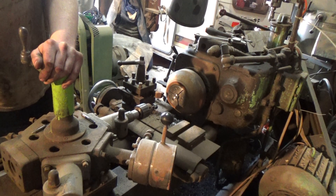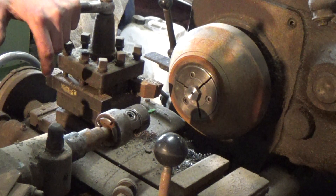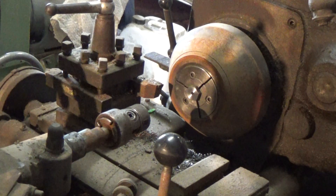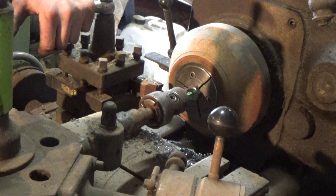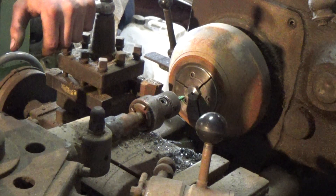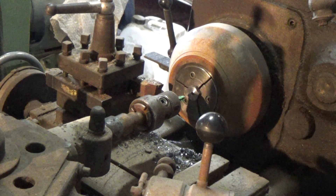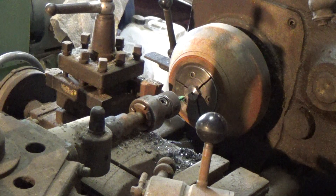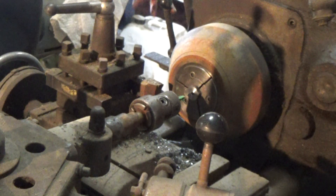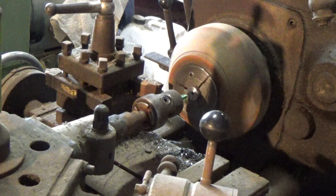Go for the tapping. So I've put the tapping head into the capstan now, and all I've got to do is just run it on a slow speed into there. Here we go — don't snap it. Put some tapping grease on as well.